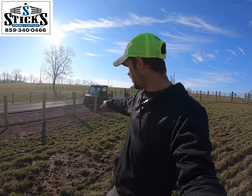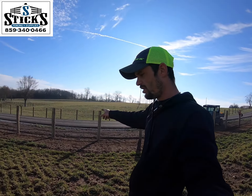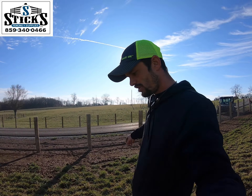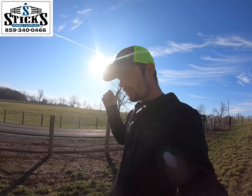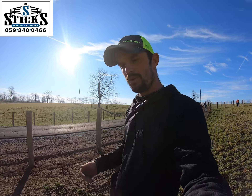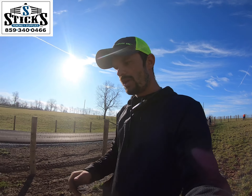Staple it up and you're ready to go. We're going to go down here and pull more on the straight stretch. You have a lot more tension on the curve than you do on your straight stretch right now, just due to the fact that we stayed off those posts, pushed back onto them, and stapled them up, which brought them to the proper tension that we need.